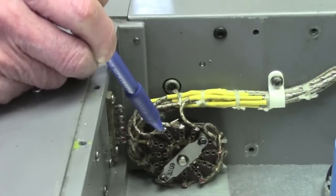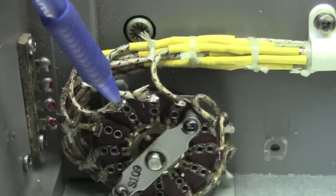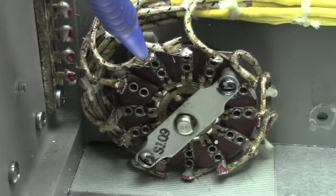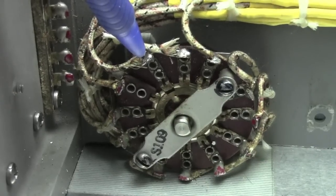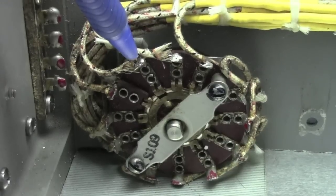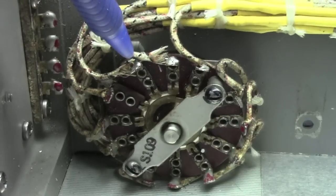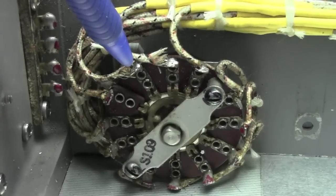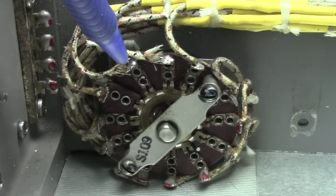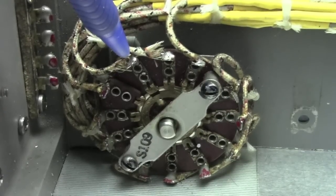In this discussion, the open seeking switch that I had mentioned is on the back side of the A dial. This is a close-up view of that switch. And what I have is my pointer here pointing to one which is the open segment. And what we're going to do is, Bill, you go ahead and switch off and back to the same channel, just so that we'll be there again. Good. Now you notice that you can see that the open sector is scanning around. And there it is. It stops right at that same point, and that's critical.